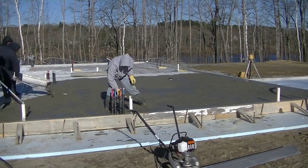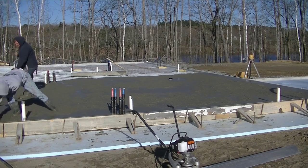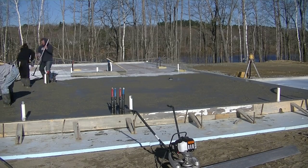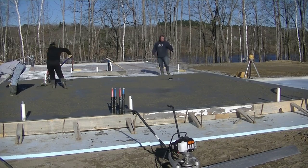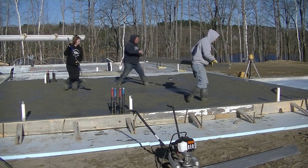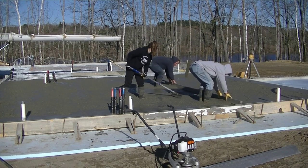I can shoot my pads right even with that on the inside — my wet pads using my laser. That laser is the Topcon RL-H5B. That's the one I use and recommend for pouring concrete floors — I'll have that down in the description. And that DeWalt pencil vibrator, I have that down in the description too. We use that all the time to vibrate our boards and forms to get really smooth edges when we strip the forms. I highly recommend that also.